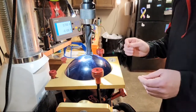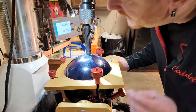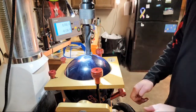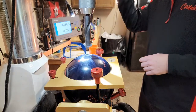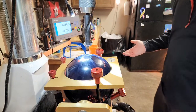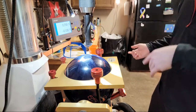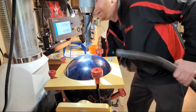And so if at all possible, I want to drill the bevel out, leave the fingers intact. I don't want them to connect whatsoever. There is always a danger of that when I drill out the bevel on my stuff, especially the fingers. But that's why I try to go with like a 3/8 bridge, so I leave myself room. If I went with a normal 1/4 inch bridge, then there's no prayer. This works, but we should be okay.